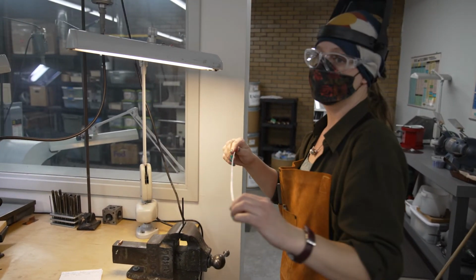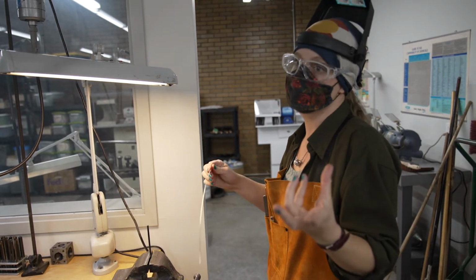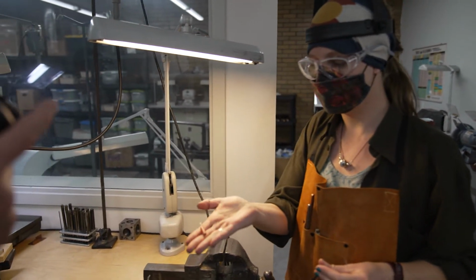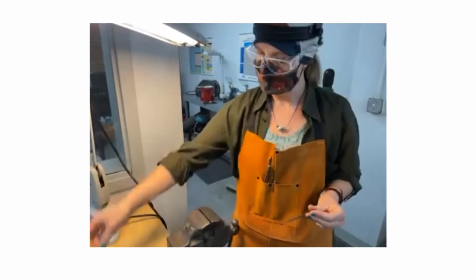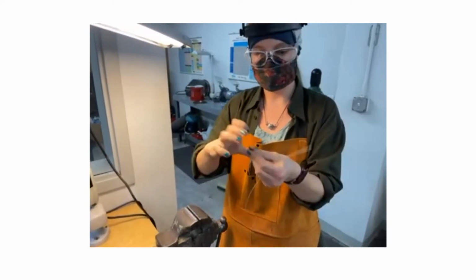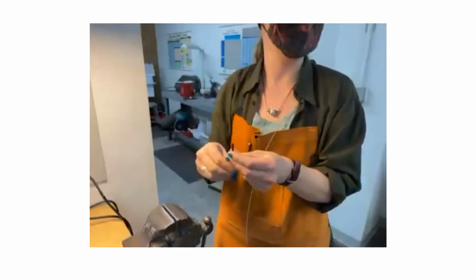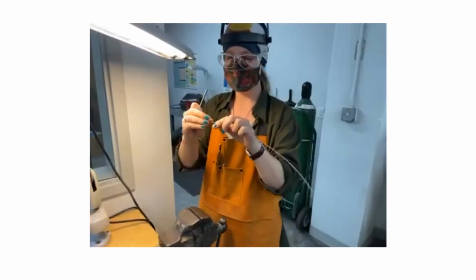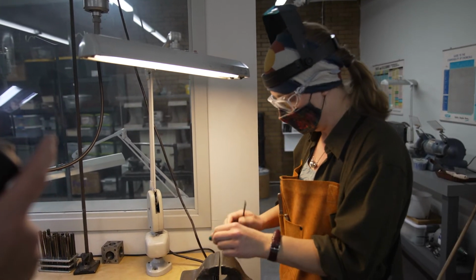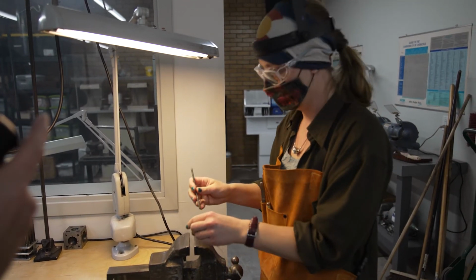It's the process of heat treating it so that it is softer again, so you can actually bend it. So now what we're doing is making a coil. Here's a sample coil in copper. We use this form, which is actually a transfer punch. It transfers a center to another piece, but it's not what we're using it for. We're using it as a solid base to wrap the wire around. We use a vise to keep things still, and it's pretty simple. You just pull and wrap.